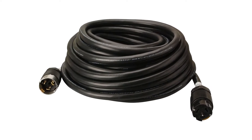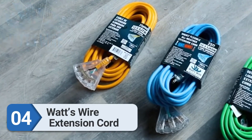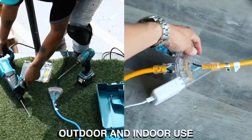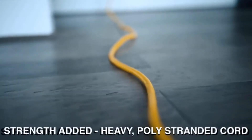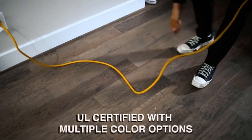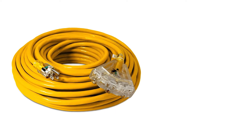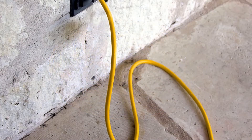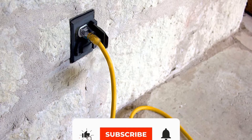Number four: Watts Wire Extension Cord. This 100-foot generator extension cord is undoubtedly one of the best cords for a generator you can buy. The first thing to inspect is the gauge rating — gauge mainly refers to the diameter of the wire, and it is best if your wire's diameter is wider, as thin wires restrict the normal flow of current. Thicker and wider internal wires make it easier for current to pass through, and the smaller the gauge number, the more amps it can handle.